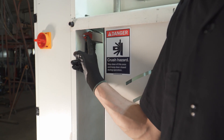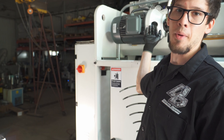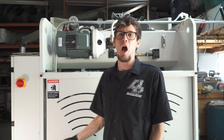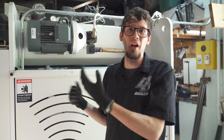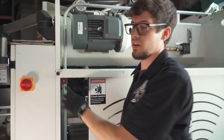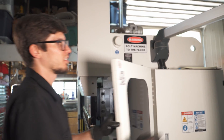All the doors on the machine have little sensors — if a door opens while the pump is running it will shut the pump off. One thing I always check when the machine isn't going up and down is whether all the doors are closed. Nine times out of ten I have a door open somewhere and that's why I'm getting frustrated that it won't operate. Good one to remember — the little safety switches.